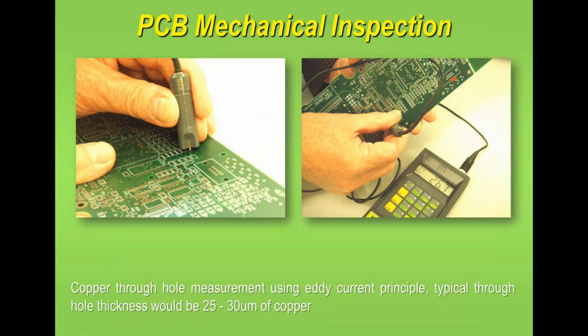Now, in terms of plated through hole boards, what we want from them is obviously a reliable connection. And it's surprising that you can have copper plating which is quite thin and still give you a reliable connection. But from a manufacturing point of view, if the plating thickness is low, then it generates problems like outgassing or blowholing during the soldering process, which then leads to spitting during hand soldering or selective soldering. It also leads to voids within the joints, which don't necessarily affect the reliability, but they certainly affect the producibility, i.e. the quality standards that you're trying to meet.